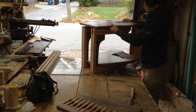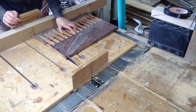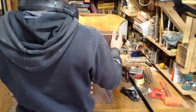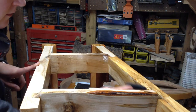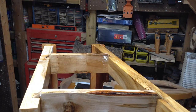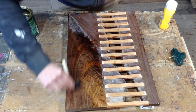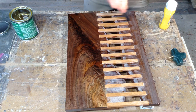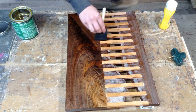I settled on the cherry top sitting on the walnut — it just looked better. I definitely flipped the piece around about 20 times to decide how I wanted the figure, whether I wanted the height of it at the top or the bottom, before finishing the base. On the base I put three coats of General Finishes, and on the back of the walnut I also used General Finishes. The Waterlox is a great durable finish, but I didn't need something so strong on these pieces. General Finishes dries much quicker — in the summertime I could get two or three coats on in one day, in wintertime about two. With Waterlox you have to wait 24 hours to dry, so it is a much bigger time commitment. One downside of the zipper table look is there are so many nooks and crannies to cover with finish and sanding — it just takes a long time.